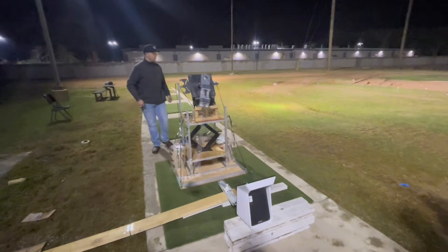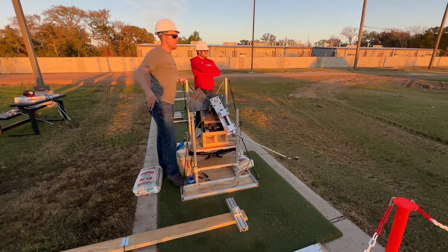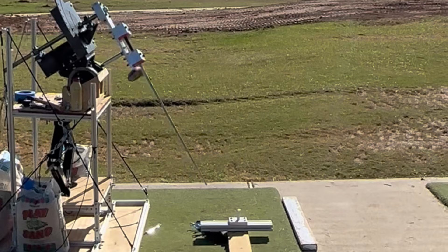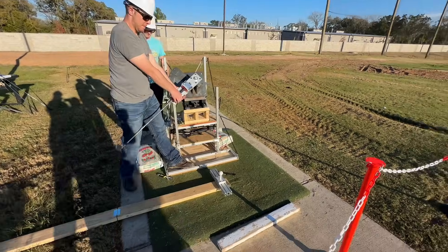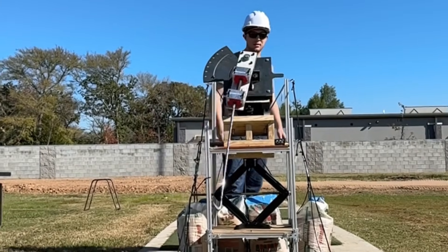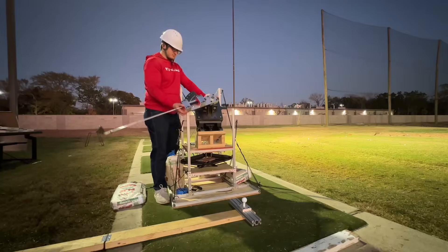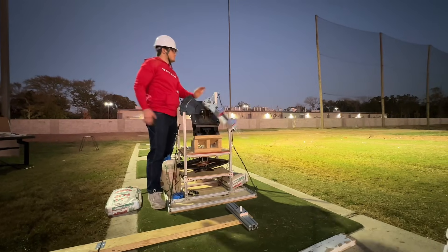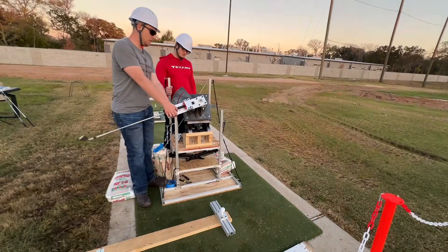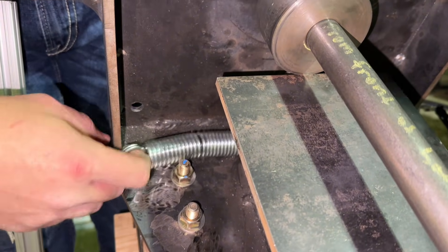With moderate torque springs, we achieved swing speeds which maxed out at 55 miles per hour. When we tested with a much higher torque spring, the force exceeded the limits of graphite and steel shafts, causing them to break. While this might seem like a failure, it actually validated our sponsor's explanation that each shaft has a defined limit of how much it can flex, and exceeding it will always cause a break — even with human golfers. With lower torque springs, we successfully produced shots traveling approximately 50 yards. But because these springs were lower quality, they eventually stretched past their compression limits and broke mid-testing. After speaking with our sponsor, they plan to order custom torque springs that match their testing speeds, which will unlock the full performance range of the machine.